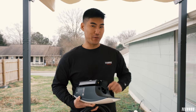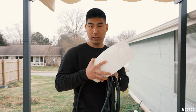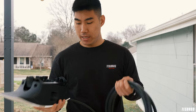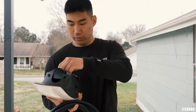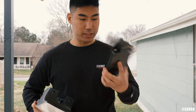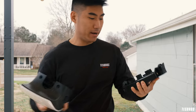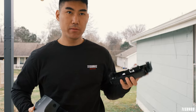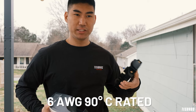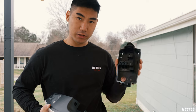I got myself a Gen 3 Tesla high-powered wall connector. This was used — it's from a brother of mine. It's the 20-foot version; they actually come in 20-foot and 8-foot. You get this bracket where all the wiring goes in, and there are actual connectors that connect from the back. It is a three-wire setup. The minimum requirement in the Tesla manual is 6 AWG, 90°C-rated wire.